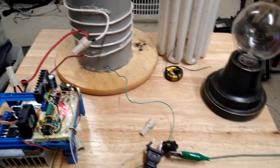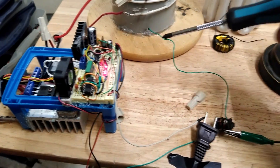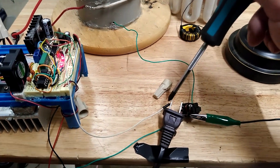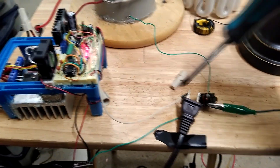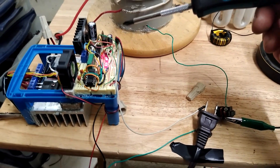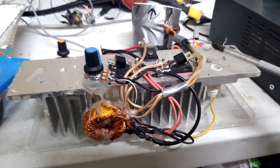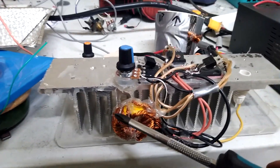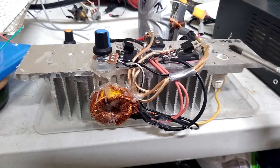When I bypass the bulb you can see it just starts overworking again. Having that load on there is helping for some reason. I'm in the stages of just playing around with it from the ZVS to see if this output is just too much for it. This is high voltage — if I remove that lead you're going to pull a nice arc off there even though it's isolated. I was hesitant at first to run that straight in, but this is more or less what happens with the GDT. All of the GDTs on these low voltage circuits look like this but bigger — you've got that high voltage feeding straight in, grounded to circuit ground, the battery negative.